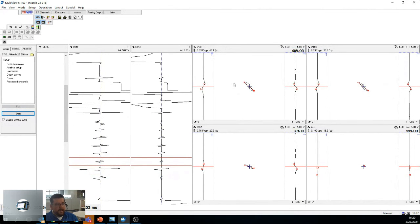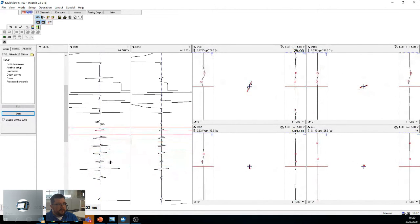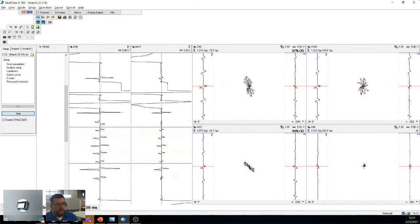And also, you can basically say it's a hole at this rate, it's a leaker. And then as you go through, you're getting different readings, as you can see with what I call the flower image. As the defect gets closer to the OD, it opens up like that flower. It changes the phase. The reason is it takes longer for the eddy current to penetrate the wall, find the defect, and then go back to the probe. So that explains the flower effect here.